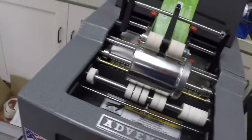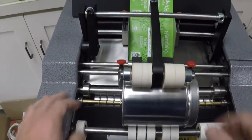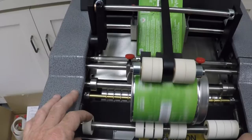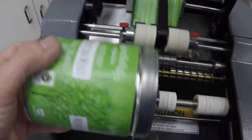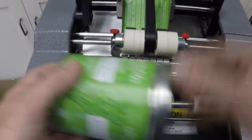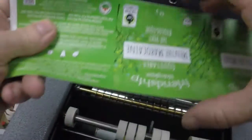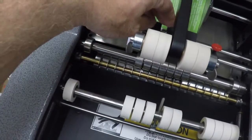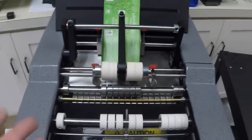Okay, now we have a label feed timer. I'm going to increase it to 6 to give it a little bit more dwell. And then we'll get that label to go on. And you can see it goes on just perfectly. These labels, we have a very limited stack, so usually I could adjust it. There's a label feed finger that you could adjust that's actually slotted for different label thicknesses. Generally, when you're dealing with very, very small stacks like this, you might have to back off the pressure a little bit. I'm going to reinsert it, and then I'm going to try to do 2 containers in quick succession just to give you an idea of how fast you could go